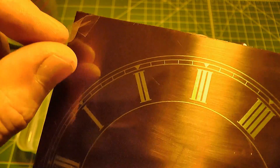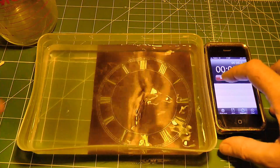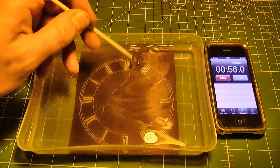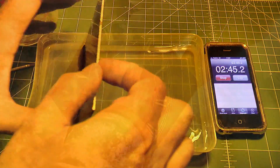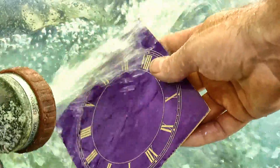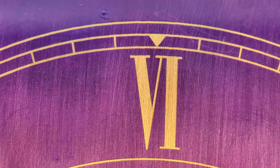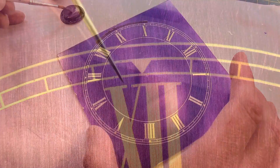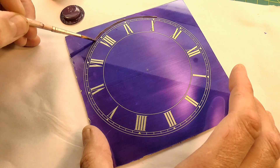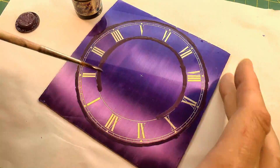The second protective layer was then peeled off, and the mild alkaline solution I prepared earlier was used to dissolve the unexposed resist. For the most part, the exposed resist forms a nice crisp line. But inevitably there are small printing flaws that need to be removed, like these small dots — I scraped these off with the sharp point of the scriber. I also gave the artwork a touch-up with some paint. When I made the graphic I had intended to have terminating rings on the inside and outside, but I've since come up with a different idea that I'll show you in the next video, so I've painted over those rings so that they wouldn't etch.